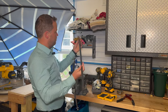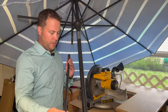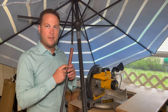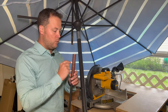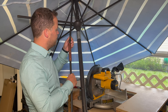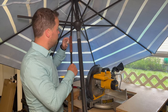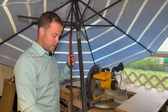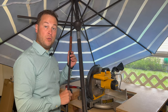We are halfway there. So we've already riveted the broken piece of the rib to our six inches of copper tubing — that's riveted, it's done. We've got this middle screw in here, which is actually very important beyond just having a center point — that's going to come in handy in a minute. I've gone ahead and pre-drilled the hole by simply sticking it in here; it hits the screw, and then drilling the hole in. All we have left to do now is rivet the broken piece with the tubing to the piece still attached.